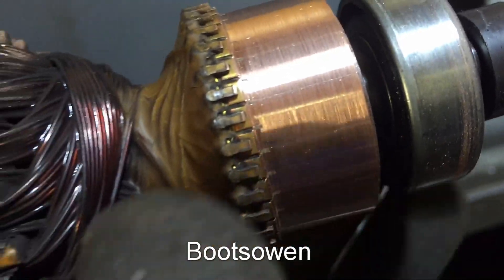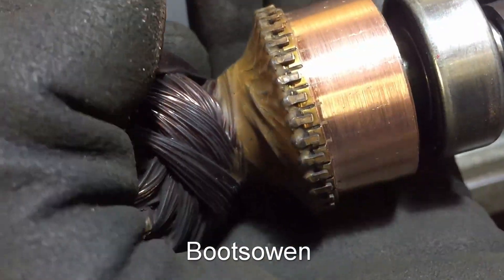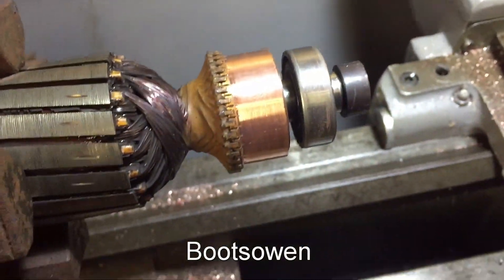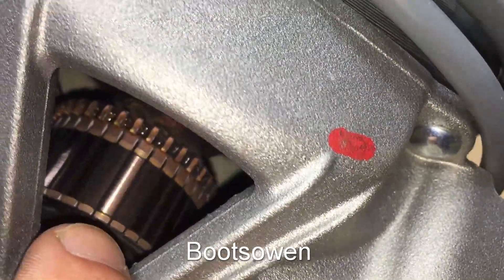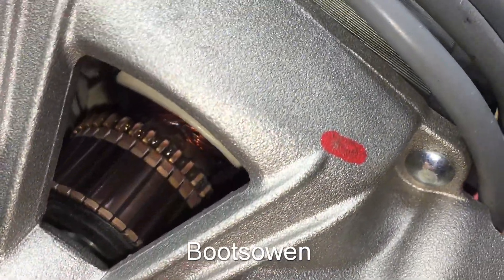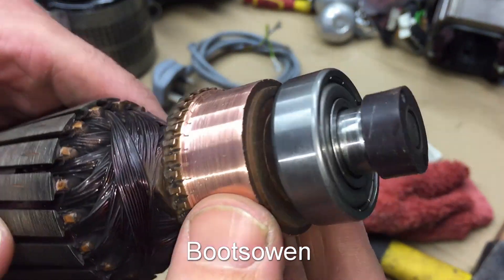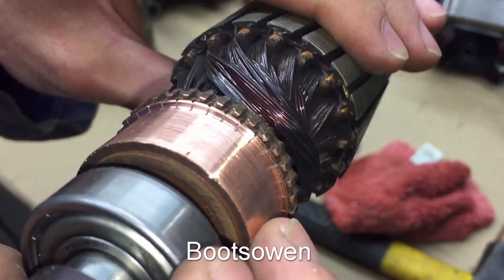When we get close up you can't see the gaps in the commutator ring, but I think I've gotten a good finish on it — not that there's much of it left. I wonder will it work? Here's a different motor for comparison and you can see the big black gaps in between each of those commutator bars. This one's quite good and clean. But this is the one I've just touched up and it's become one solid mass of copper, so I'm going to have to try and cut out the gaps between each one somehow.